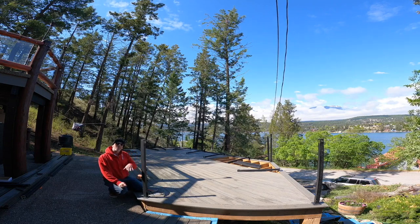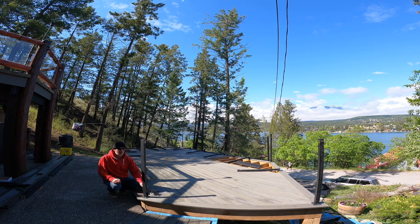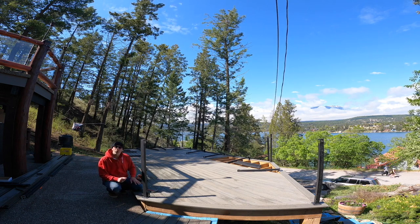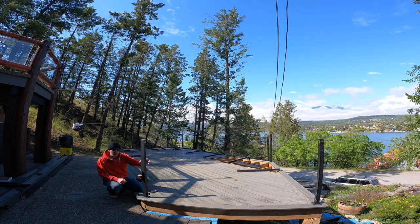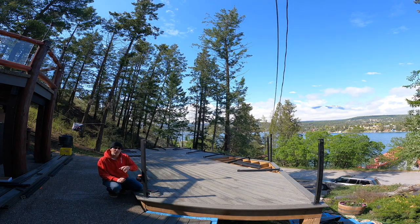Now you see there, that time I got the two ready because these ones are kind of in weird spots. One's hitting right on the joint. So I got the two in, knowing that it's strong. Now I'll pre-drill my holes and put it in. And I'm not really going through and leveling these or tightening them down too tight at this point. I'm gonna work all the pieces in to each post. Then when I'm done, I do a final leveling. So if everything's looking really good as I'm going, I don't worry about it too much at this point.